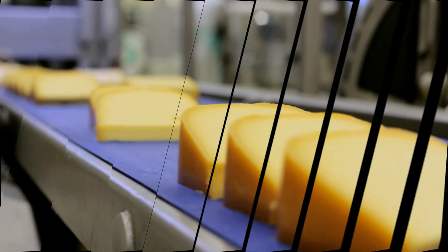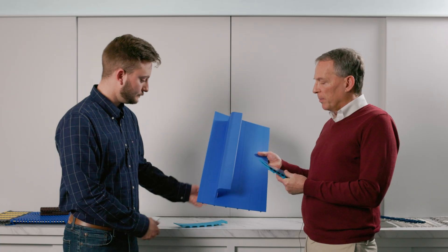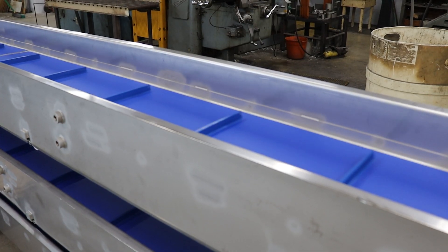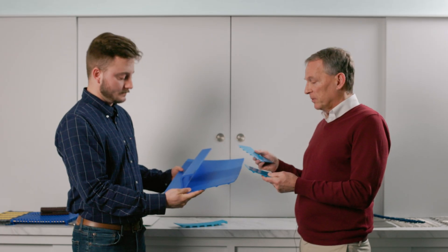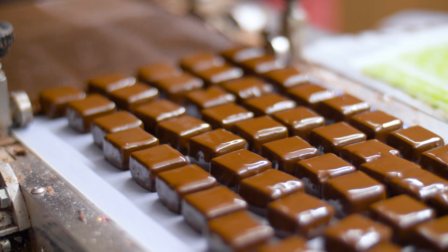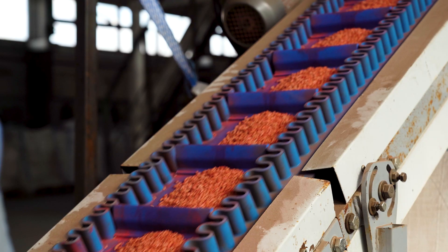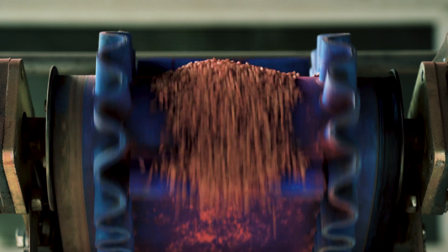And for the ultimate in hygiene, these are monolithic belts. These belts are made from polyurethane and they're completely monolithic, meaning it's the same material throughout. Fantastic for cleanliness — these are very easy to clean. There's not a lot of areas on these belts for bacteria or any other pathogens to grow or get harbored in. You can add different types of accessories to the belt as well.